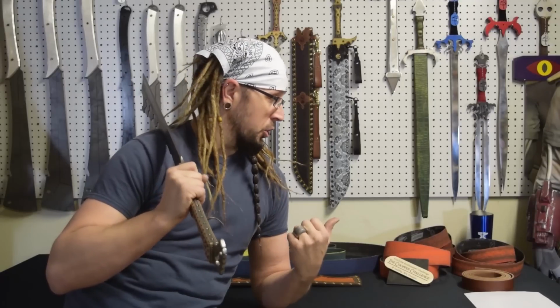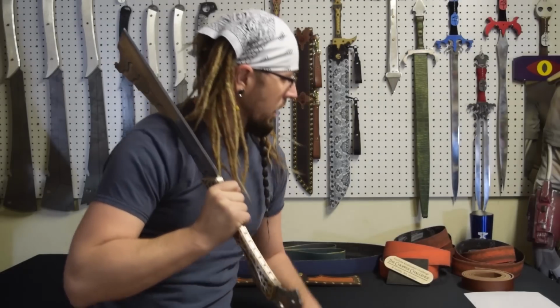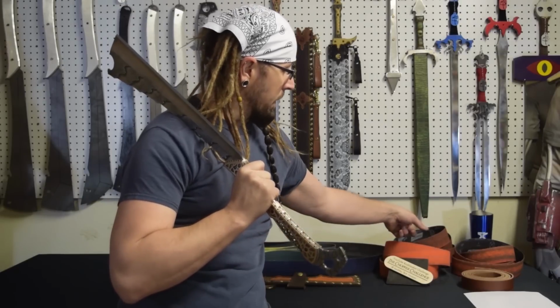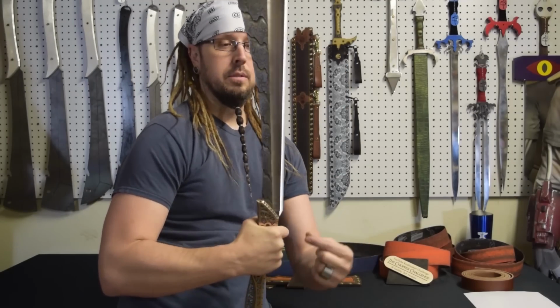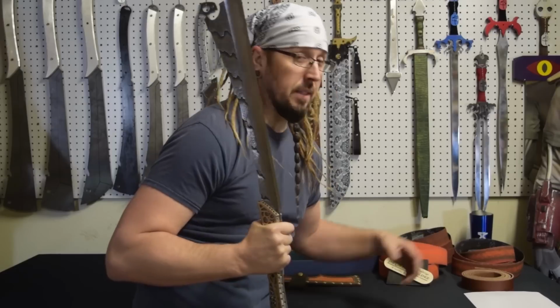As far as the video goes, I wasn't sure how many belts I used. It was three of the Norton 50 grits from Maritime. That one was the one I used for the profiling of the bronze and the blade itself. That one back there is the hollow grind one, and this one is the one I did the edge bevel on. And all three of those still have teeth on them.